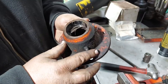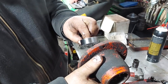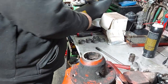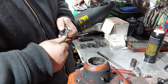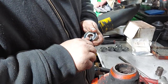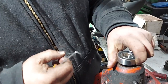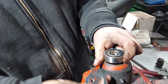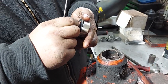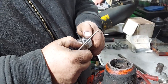There goes the bearing — the spacer is in there too. I wanted to show you there's a little bit of grease in here, but not a lot. The grease does nothing because these are sealed bearings. So if you want the grease to actually do something, all you do is just take out the seal on the bearing — if you've got a rubber seal. Just pull this out and leave it facing the inside, then when you pump it full of grease it'll work. But you need a lot of grease to fill this cavity before it even gets to the bearings. We pull the covers off all the bearings and repack them with good grease.